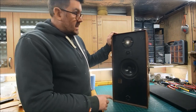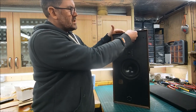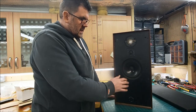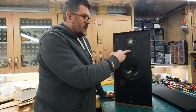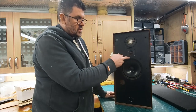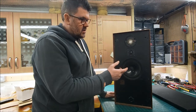This is actually the better cabinet. The other one has all the moulding around the front broken away - this is loose at the top. This woofer is dead, the HF1300 is playing but one of them is playing really quietly compared to the other. The diaphragm of this HF1300 is a different colour, different type, probably older. They are full of distortion in the measurements and I can hear that when I run the test tones.